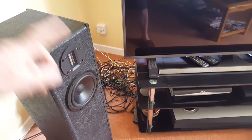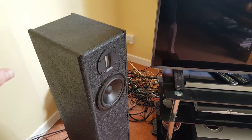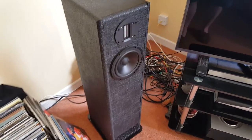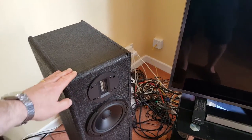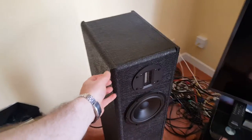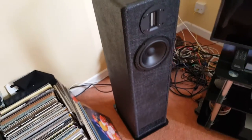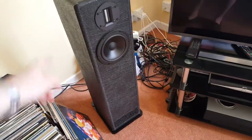The aesthetic was put together by a friend of mine who helped build the speakers. It's a very basic kit — you get instructions with drawings for the cabinet plan, plus a series of components for a small crossover which you solder together with detailed instructions. Ivan Leslie is always on the phone to give advice. Normally there's a veneer you can iron on, but we chose instead to use a guitar amplifier elephant hide finish — a single piece wrapped all the way around, with chamfered edges and a textured paint effect that looks quite monolithic.